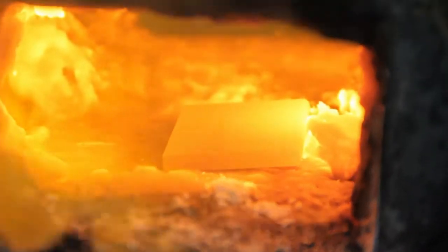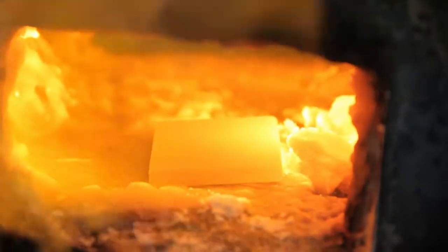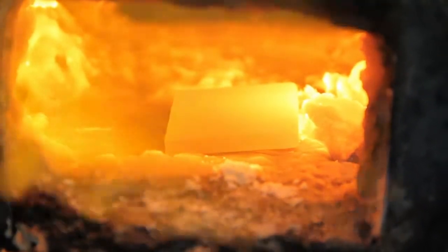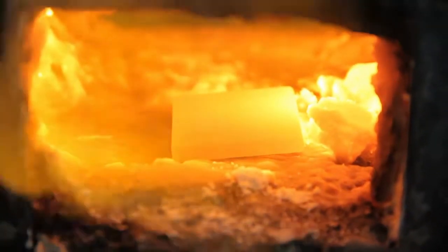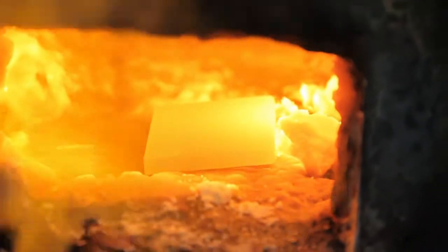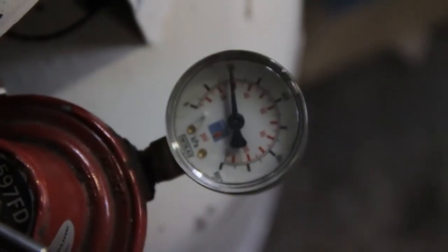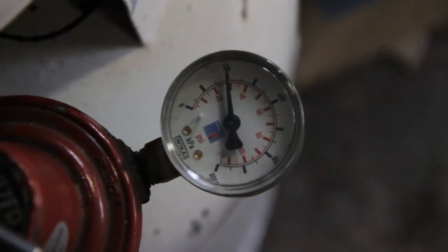See how there isn't really any scale on that piece of steel, but it is quite hot. I'm running the forge at the moment to preheat this piece of 80CRV2 to forge into the billet — the same kind of setup I'd use if I was preheating for forge welding. That's where I warm it up, try not to grow any scale, and flux it. I have the inspirator necked down quite a way — there's only a couple of millimeters gap — and I'm running plenty of gas through. That way there's no spare air inside the furnace to react with the surface of my steel. In my forge that works out to around 30 PSI with the inspirator rolled out as far as it currently is.